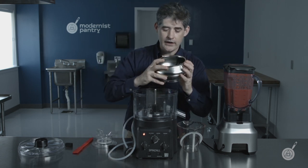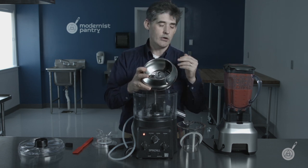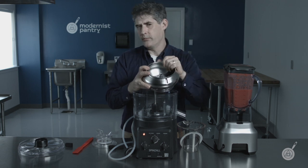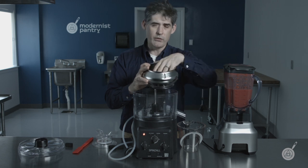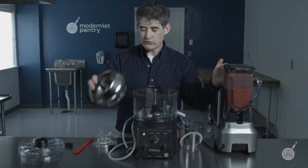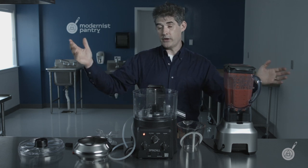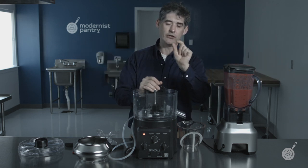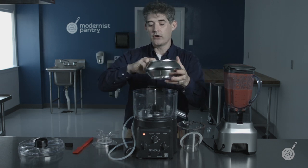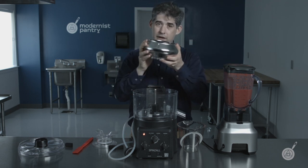The first thing you have to decide is whether you're going to start with an empty rotor or a full rotor. Certain products like bananas and rum — called Banana Justino — all the banana hits to the bottom, so you can start with a full rotor because you're not worried about stuff that's floating. What I have here is strawberry. Strawberry has a lot of particles that tend to float, and in a big centrifuge you get a mat of floating strawberry gunk that can't run continuous — it will ruin your product. So we start strawberry with an empty rotor.